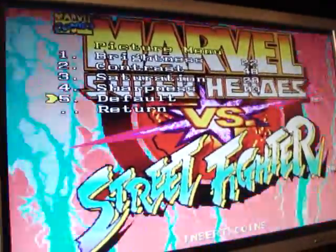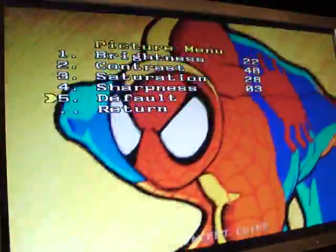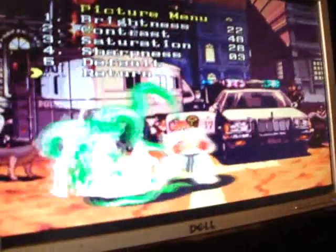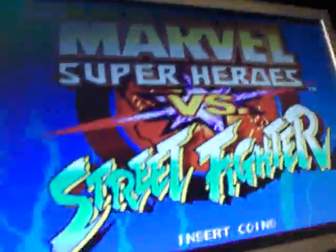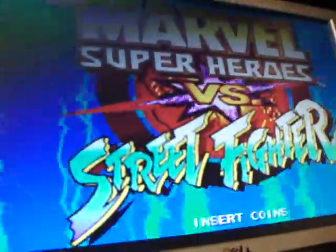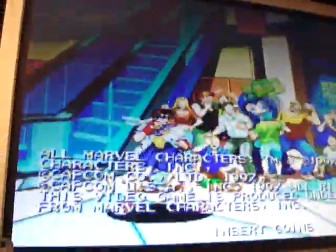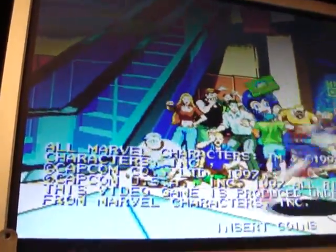You can change basically everything on here. When you first get it, your board will probably be a little bit bright. You can also adjust the sharpness and everything here. But you'll probably also have to adjust these pots down at the bottom — there are three pots right here for red, green, and blue. If it's too bright, you can use a flathead screwdriver to turn them and change the picture quality. As you can see, turning it is changing the blue. You can also adjust brightness through the menu settings.